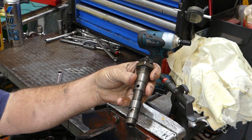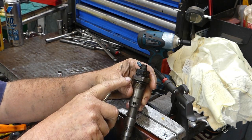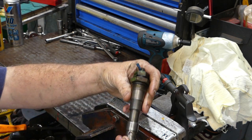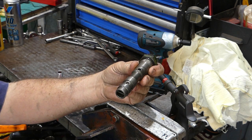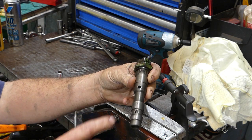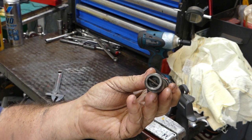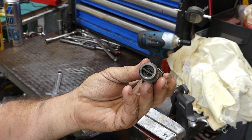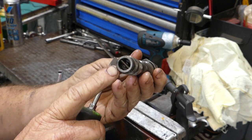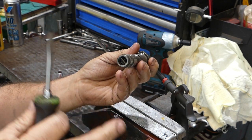The first thing when you undo it — and I started undoing it where I split the tractor — you just grab an inch-and-a-quarter spanner and undo it out of the housing. It's a little bit different from the 1640, 3040, 3140 series in that the nut is part of the whole cartridge, but the same principle applies. The very first thing you look at is that roll pin up the end there. It has to be intact. I've seen them where you open this up, first thing you look at is the roll pin, and it's broken.